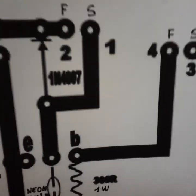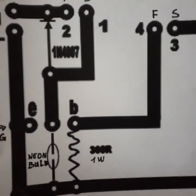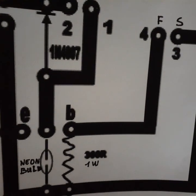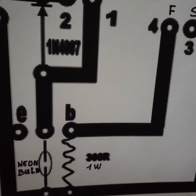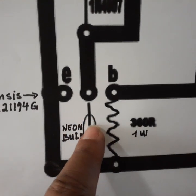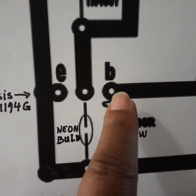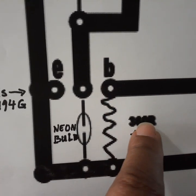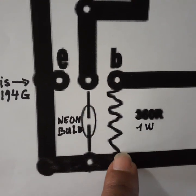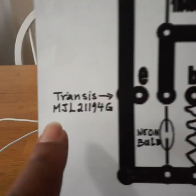Let's resume our talk today. The changes made to the brushless Neumann motor circuit — which I rename the brushless Neumann Bedini motor circuit driver — because it's a circuit driver. Two changes: I added a neon bulb between the collector and the emitter, and a 360 ohm one-watt resistor between the base and the collector, designed to protect the transistor.